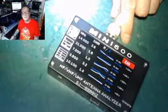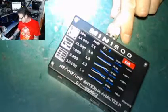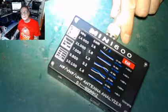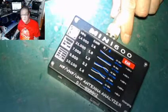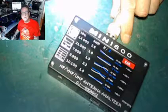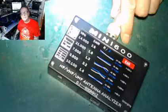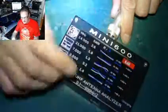I'll switch over to the, surprisingly, oh, it's on the Hustler already. That's why. So we're getting pretty reasonable SWR on 40. 80's a bit high, but that depends on whereabouts it's actually looking in the band, because if you go a little higher, it gets better. So they're not too bad. I'll switch to the beam, and then I guess I have to do it again.